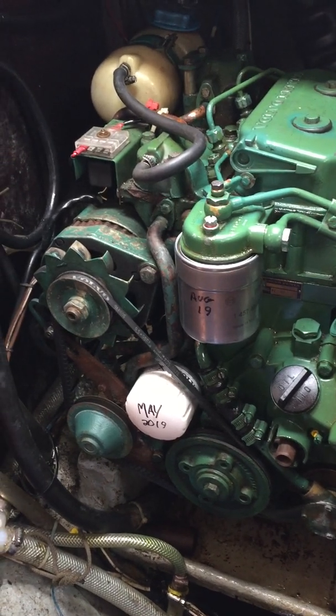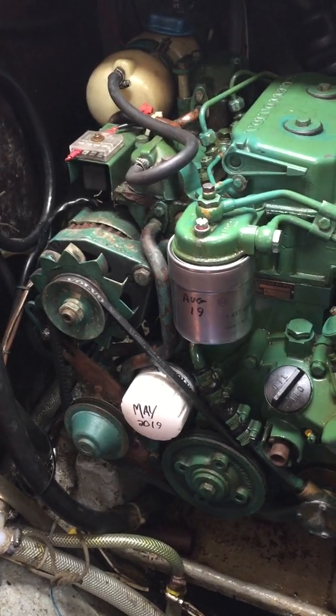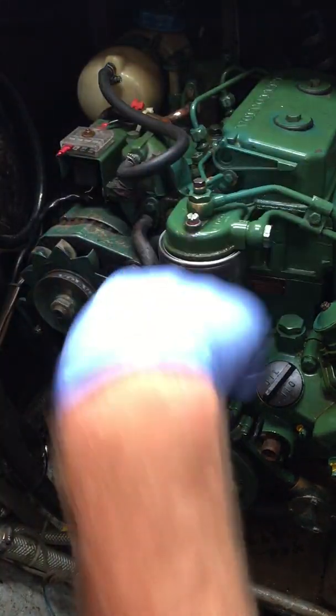So how does it work - does it take the salt out? No. On a standard salt-water-cooled engine it literally blasts salt water around the engine, around the cylinder head, and then dumps it out of the exhaust. But this one isn't - this is fresh water cooled only, so it's separated.